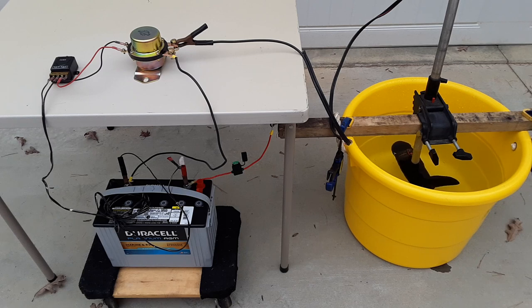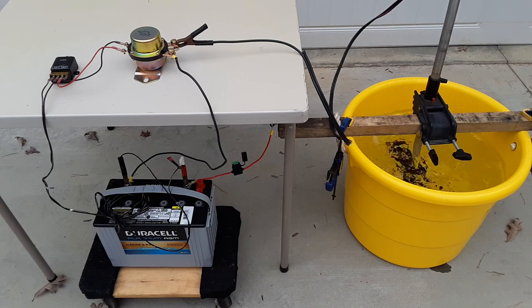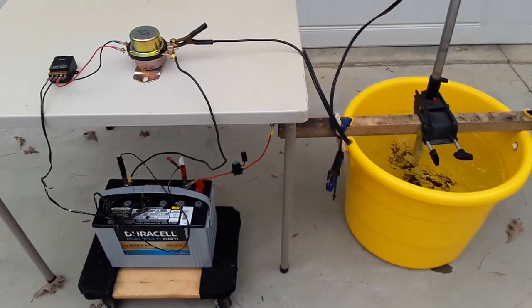Right here I have my full load testing. I have my water tank, which is the yellow bucket, and I have the 30-pound Motor Guide trolling motor set in there. The reason I want to test this is to get a better idea of the amps being drawn by the trolling motor under a full load — in other words, being in water — along with the amps drawn by the relay switch itself, just to make sure everything is going to work out all right. I have my little fob here and I'm going to start the test. I'm going to hook up this amp meter, which will read the amps in DC current, and take readings to show you what the values are.